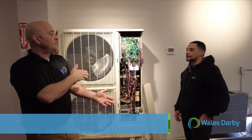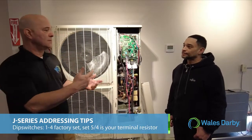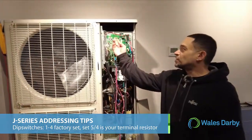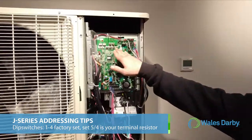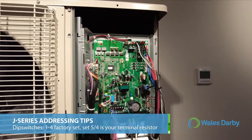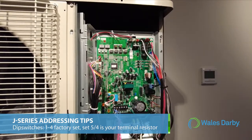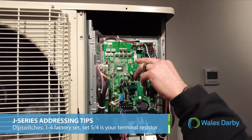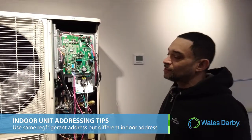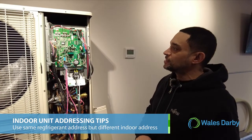So last Wednesday we did an installation video on J-Series, and we talked about addressing. So just while we're right here, let me show a little bit about the address. This is your refrigeration address. All the dip switches up here on the J-Series are set from the factory, so set 1 through 4 does not need your attention. Only set 5-4, which is your terminal resistor. The indoor units must have the same refrigeration address, but each indoor unit must have a different indoor unit address, which we'll show you as we continue.